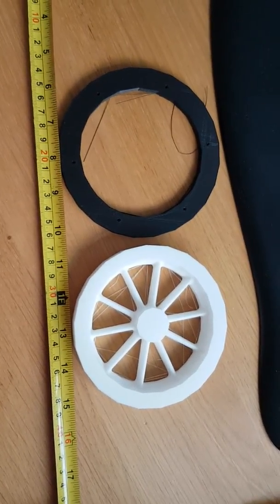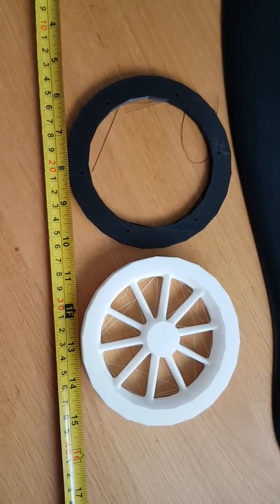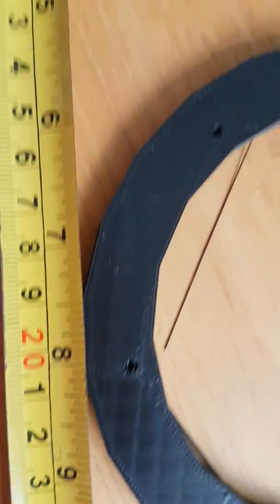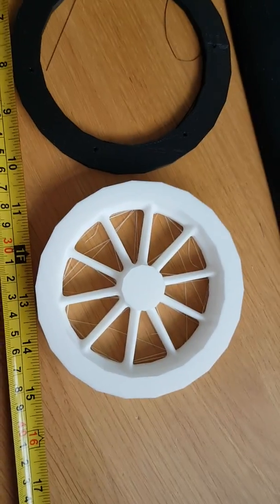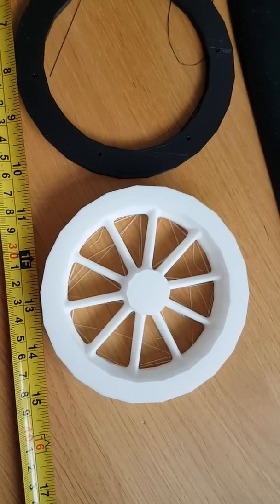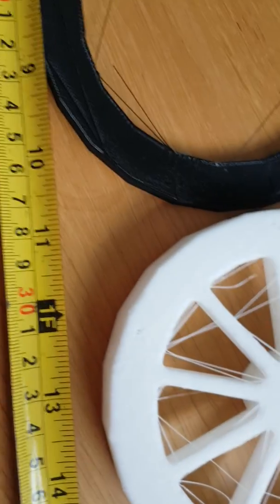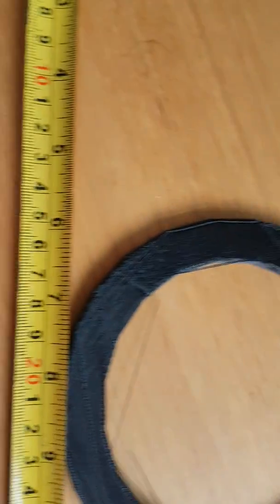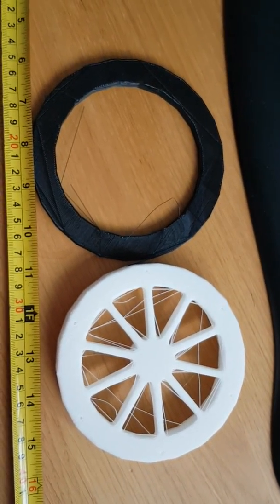It's the same principle as the large driving wheels that I showed in the previous video. Pins locate the rim onto the back of the wheel using these small little holes here. As you can see around the wheel, they fit into the back of the wheel when we start the second part of the sand imprinting process. I'll just flip them over. Now you can see the small holes on the rear of the bogie wheel that will locate the rim as seen there to give you the rear of the pattern.